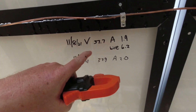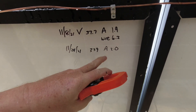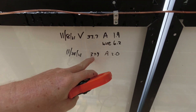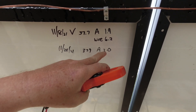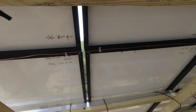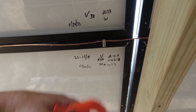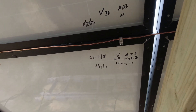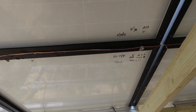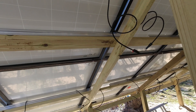On a previous test on November 8th, we got 37.7 volts at 6.2 amps — roughly 240 watts. Today in the shade: 37.9 volts but only 2 amps, so about 80 watts. Another panel: previously 37.4 volts times 6 amps, about 240 watts; today 38 volts at 1.3 amps — even worse. It really just depends on conditions because panels don't do what they say on the label.